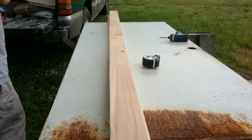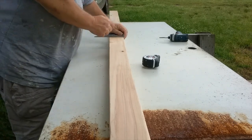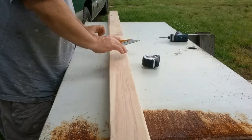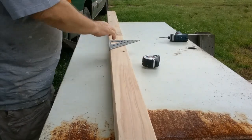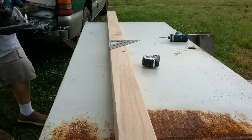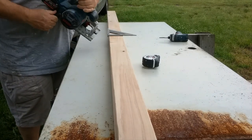In this case I just used tile. Here I'm cutting — the cart is about 49 and a half inches long. I should have went a little longer. Lowe's said these fence pickets were five and a half inches wide — they're considered six but they're really five and a half, actually about five and nine-sixteenths. So I figured on five and a half, 49 and a half inches.